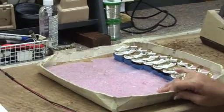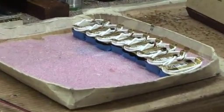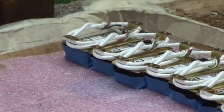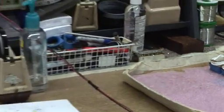What Nancy is working on right now are Tremonti pickups. These are very, very hot pickups, and very popular for the accessory shop. When she gets them, she takes our coils and those pickup bases you saw, puts the coils on there, puts the magnets on, wires everything off, tests it, and then wax pots it — which takes us over here to Carrie.